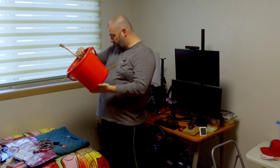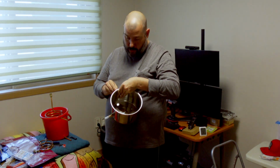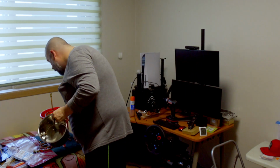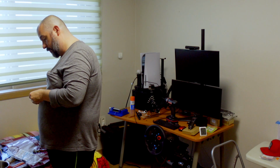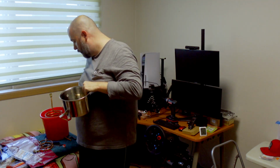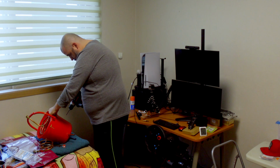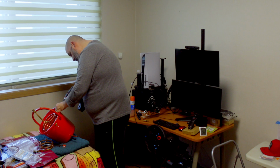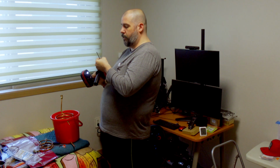Oh, right, the side things. I gotta put those in. Now let's grab this and see what size our holes are here. 4.5. That looks like it's right up at a half. Let me grab this third one here. It's part of a kit. We'll check and see if it's got a bigger setting that we can verify with. Yep, looks like 1/2 inch is it. All right, we're gonna want one right about here. And then we're gonna want one up probably about there. All right, that's the pilot holes.